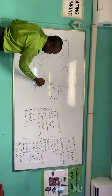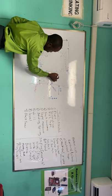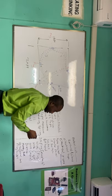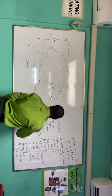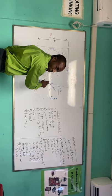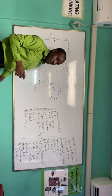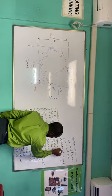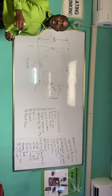For the light circuit, you're going to need one from here to the switch, and going across you'll need a further two. So that's two, four, six, eight, nine — I need 10 lengths here. You'll also need one for the earth run, going from the panel down to earth, and usually the earth run would go somewhere outside, so you need a pipe for that as well. So instead of 10, I'm going to say I need 13 lengths of pipe, adding a few extra.